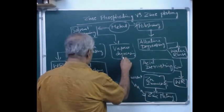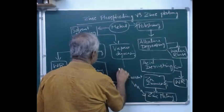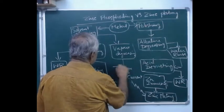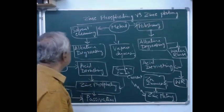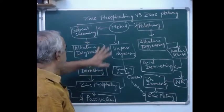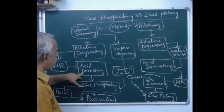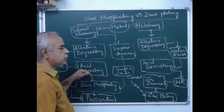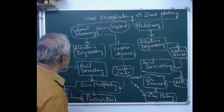For other metals they go straight away with zinc phosphating after surface conditioning. So one sequence of operation is: surface conditioning followed directly by phosphating. Another sequence is: alkaline degreasing by hot immersion or spray method, then water rinsing, then the metal panels or components are subjected to derusting using acid with a specific chemical composition.